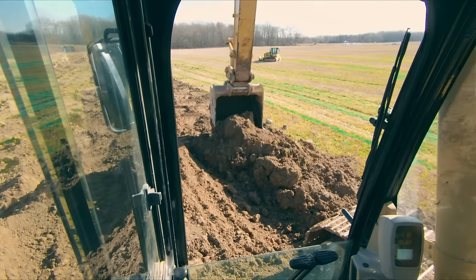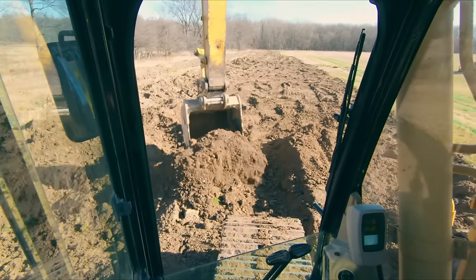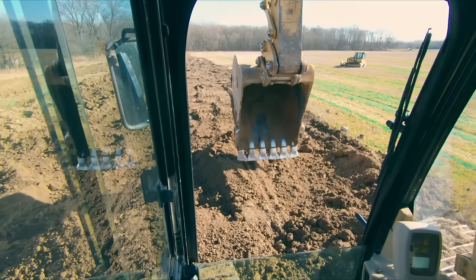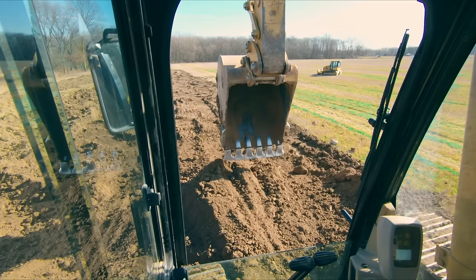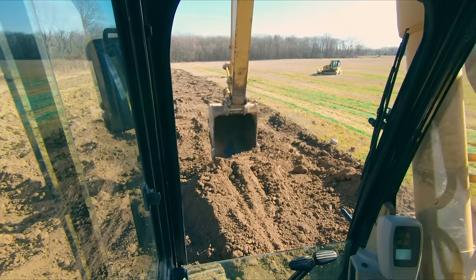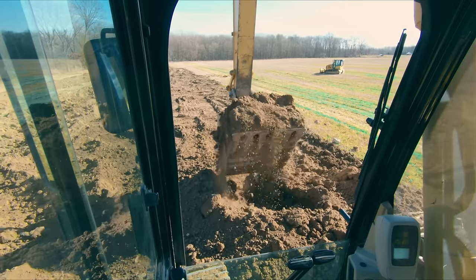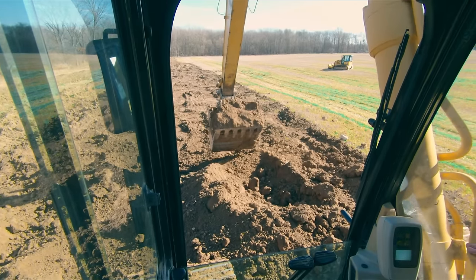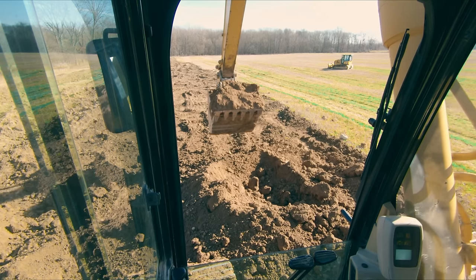So we'll take a little material and we're gonna throw it right here against our track. And now as we cap forward, it's gonna pack that material down. And you can see we've got a little bit of a rise, but that's because that material's still fluffed. So a way you can compact it and get yourself leveled out, get you a bucket, stick it out there, and just drop the boom. I don't know if you could see it on the camera, but I could definitely feel in the machine, we sank about 2 inches on these tracks, and now I'm nice and level.